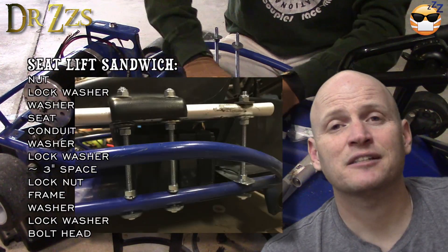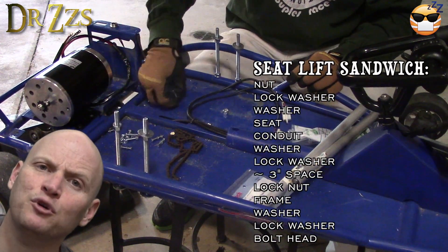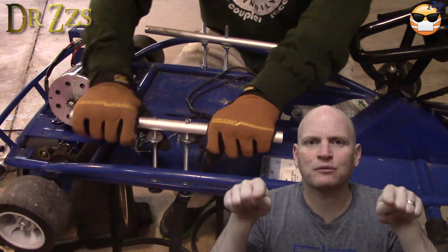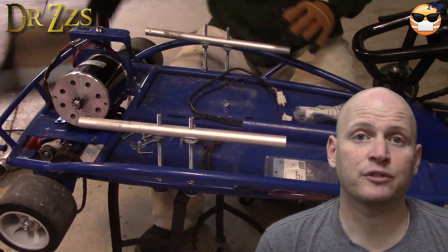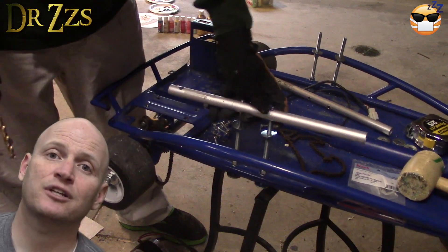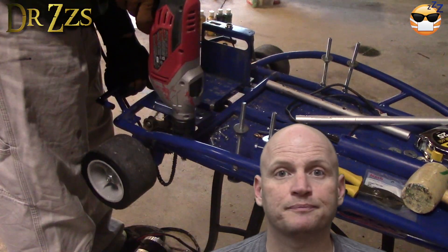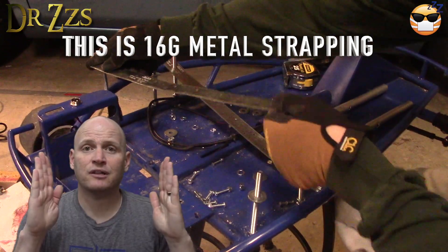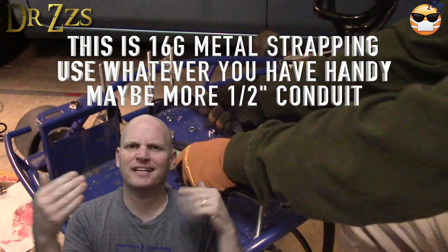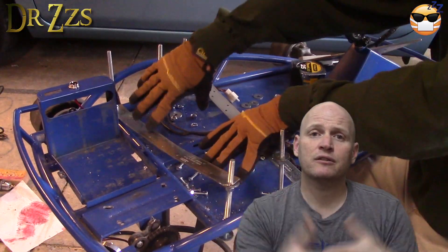To raise the seat, I got some six-inch threaded bolts with three nuts and a couple of lock washers for each bolt. I had this aluminum tubing — not everybody's going to have that, but you could probably use half-inch conduit instead. The way the seat mounts are rounded, it seemed like a better idea to have something round in there. I also wanted it to extend a little bit so I could have an extra bolt further back, so that all of the seat mounts weren't just in the middle — I was afraid that could get a little bit unstable. Once I got the bolts in, I was concerned about lateral force: going around a corner, the seat's going to tip and those bolts are going to twist and bend if I didn't have some sort of crossing support. I spaced out the screws so I'd have enough room to put the batteries in between the crossing supports.